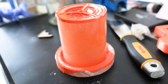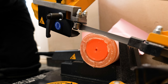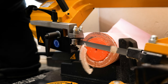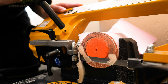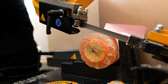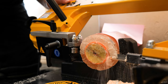I probably did this a little bit wrong because I didn't put any release agent around the 3D printed parts, so when I pulled it off it left the impression of the 3D printed part on the rubber. Here's where I really screwed up — I tried to cut off the excess rubber to clean up the edges. Don't do that; you cannot saw rubber. And because I didn't put any release agent on the bottom either, I really had to yank the rubber roller off the 3D printed part, which caused an absolute mess.